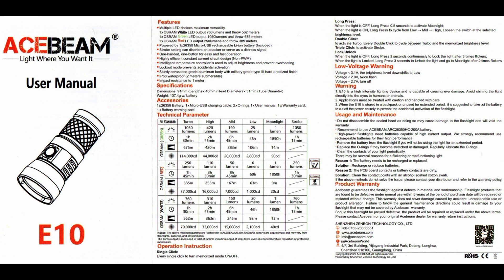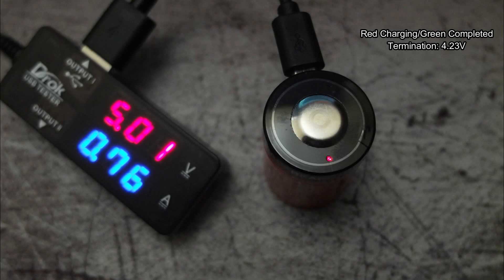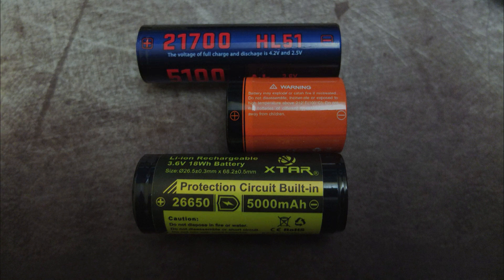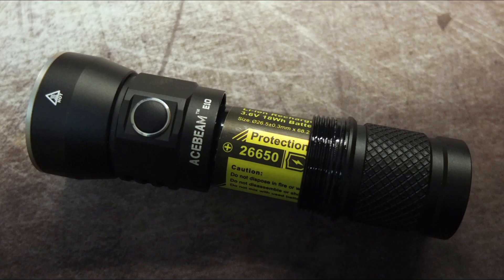Here's the user guide — I'll put it on screen so you can have a look; that's got all the different LEDs, the red and the white. I did a test on the battery that came in — it actually came in slightly over the quoted 2000 milliamp hour. The charging speed is about three quarters of an amp, although it does terminate a bit over 4.2 volts. Quick comparison with the 26650 and 21700 — you can see it's about half the size of a 26650. I do wish they had included some additional extension tube, as that would have been a nice touch.